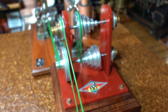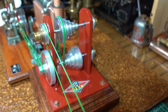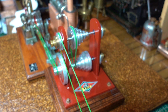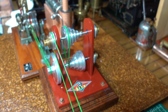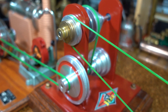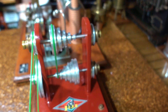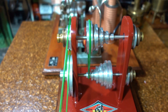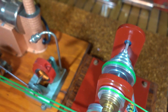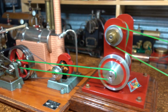It's really handy for reducing and increasing speeds, which is always something that's pretty difficult with these toy steam engines — like you're trying to run accessories and they'll either go too fast or too slow, the engine hasn't enough power or it's got too much. This transmission is able to — pretty close to indefinitely — let you change the pulley and belt to reduce or increase the speed to pretty much anything you want.